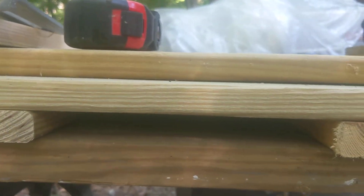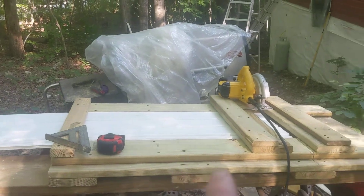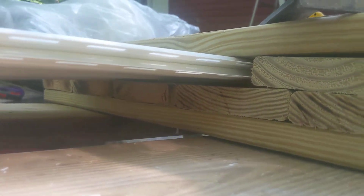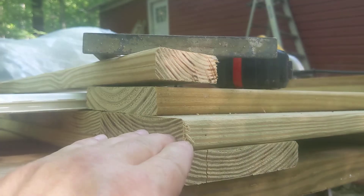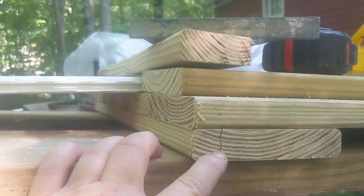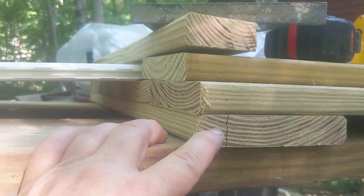So you can see what I did here. I've got five boards. This thing is four feet long — four feet — and I've got five boards. All I did was cut these at four feet, put them together, and screwed these on them, then flipped it back like it is sitting right here. I did five of these, cut at 27 and a half inch — that's the width of five of these boards that have shrunk. Pushed them together and made this at 27 and a half inch.